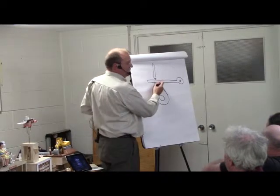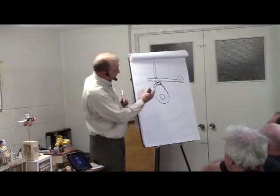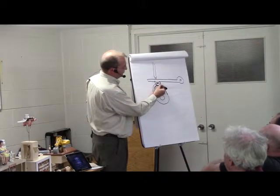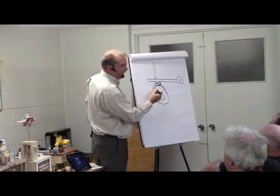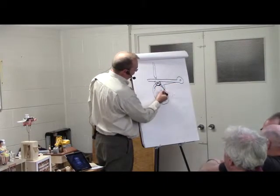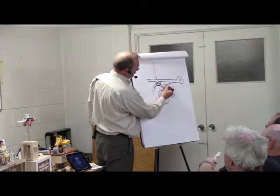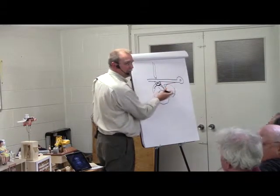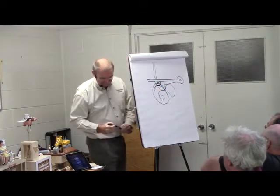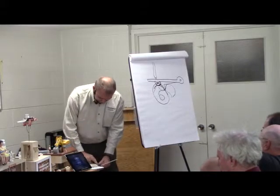So these followers do a lot because they take all these lateral forces. These pieces up here have a follower on every cam. Okay, again, I lube this so they slide. The only trick now is you can't have a cam so big that as this drops down to follow the other side of the cam, it actually interferes with this piece up here. So you always got to keep in mind the distance you have so that the cam follower doesn't interfere with the shaft, okay? I'm really throwing my stuff around up here now.